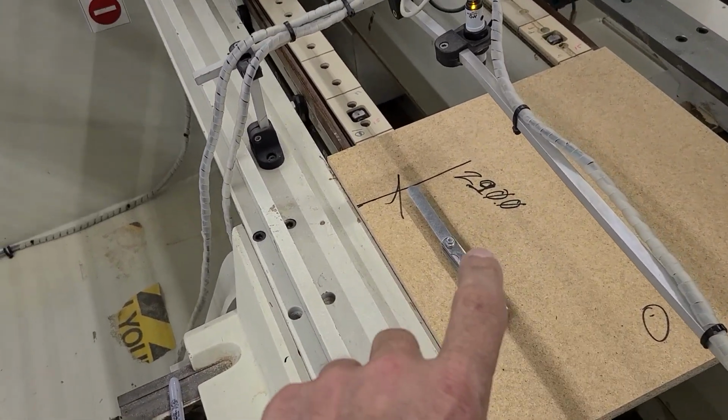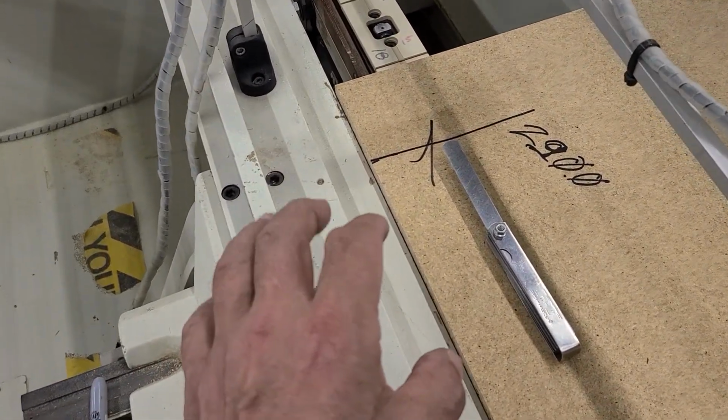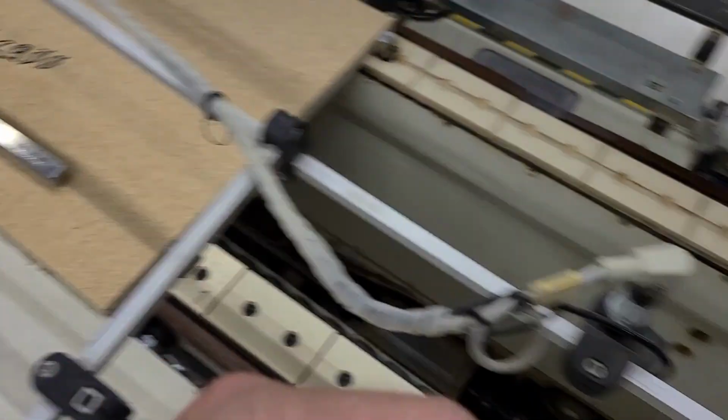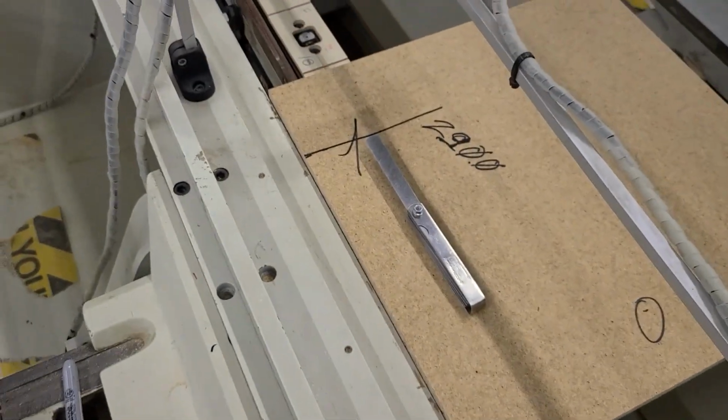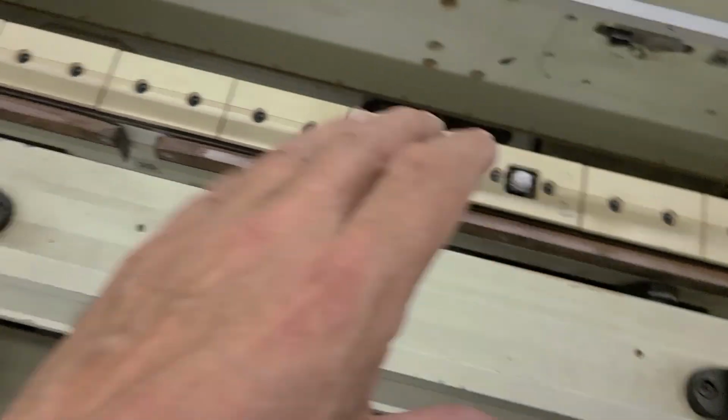They are absolutely dead on square, to the point that I cannot measure them with even the instruments that I carry. I did set up the 290 millimeters. That is our distance from dog to dog. Put that back on here. Now what I've done is I've come over to my saddle, straddled my saddle, because that takes the flex out of this part of the fence.